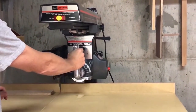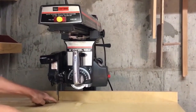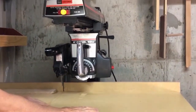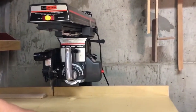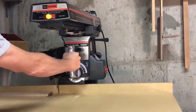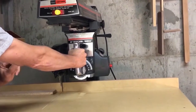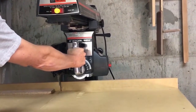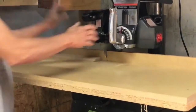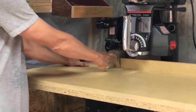As such, you never want to have your hands anywhere near the direction this blade travels, the path this blade travels. When the saw is turned on in any of the crosscut positions, one hand should be on the handle, the other should be holding down the workpiece. Or if the workpiece is clamped, the hand should be on the side of the table or in a safety zone. Your free hand that's not holding the handle should always be at least six inches from the blade.